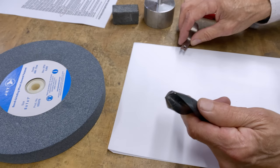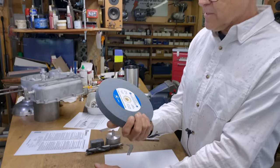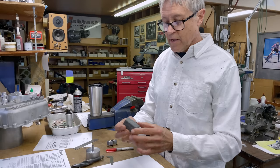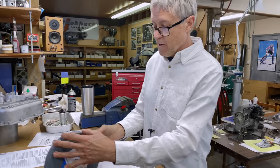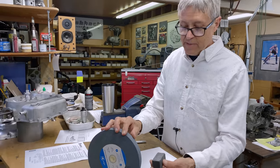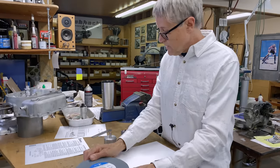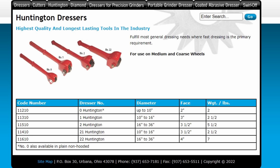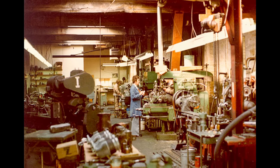You need to sharpen the wheel. I've got a new wheel here — it's 50 bucks. How do you sharpen a wheel? Well, you can buy a stone and while the wheel is running you can run it across like that — that does okay, but it's not great. Then you can buy what's known as the Huntington dresser — that's what they look like, and these work okay too, but they're not great. When I was younger I worked in an automotive machine shop, and there was a lot of grinding machines there.